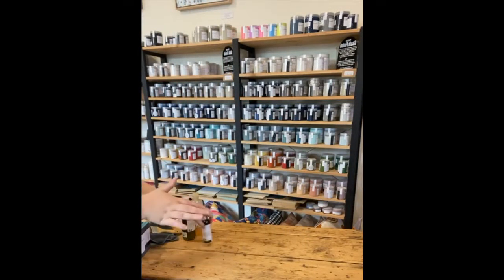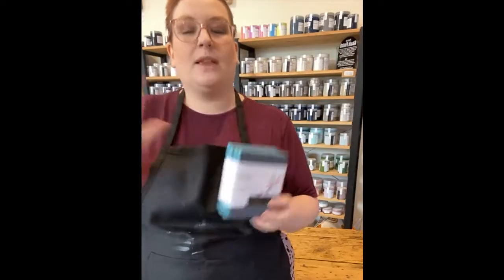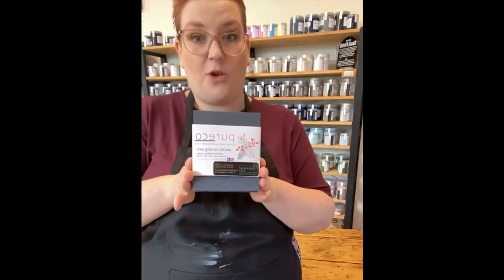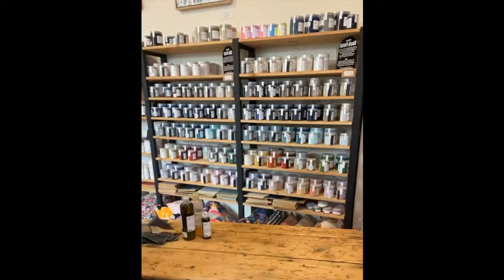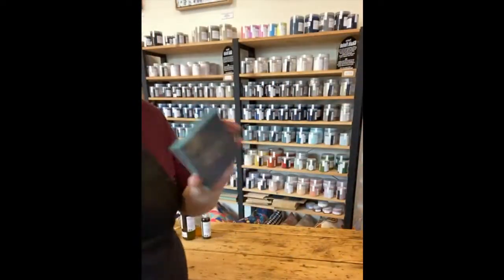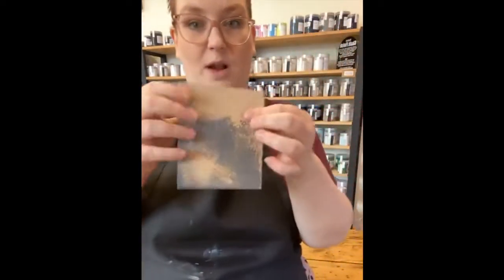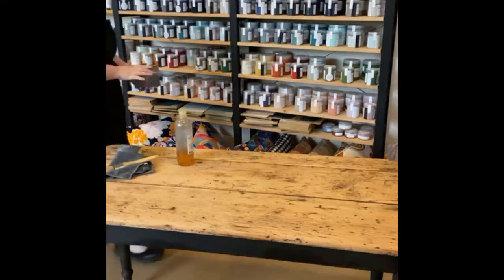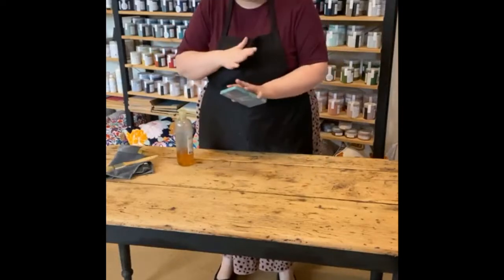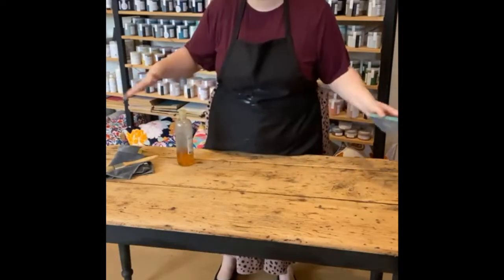So to begin with, we've cleaned it. Next, we're going to come in with some sandpaper. I just want to give it a really light sand — it's just going to knock back those fibers. It is feeling very rough. I'm going to be using the Purico sanding sponges. They come in a pack of four: 320, 220, 120, and 80 grit. I'm going to be using the 80 grit today. These are great because you can wash them. All I'm going to do is sand lightly all over. I'm not trying to remove anything — I just want to knock back any fibers of the timber and make sure that we're ready for our oil.